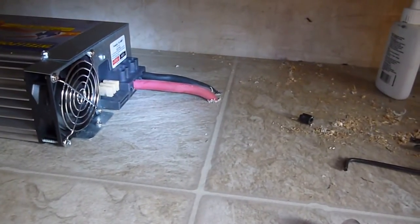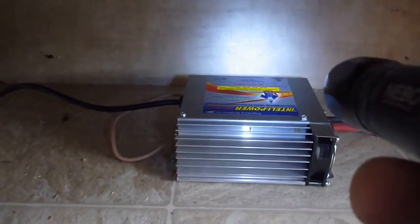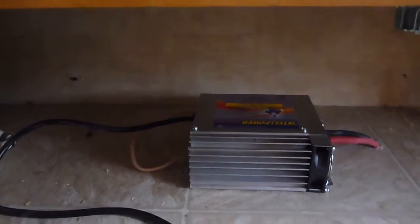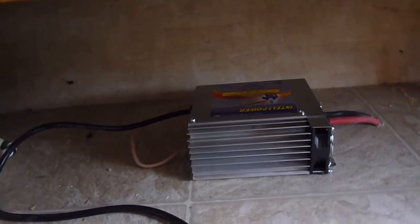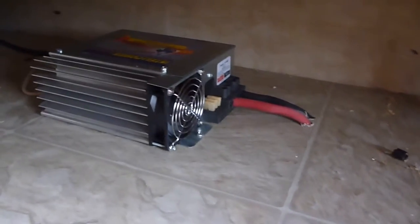They'll work just fine — if not a little better than a smaller size. The white wire on the back goes to the ground on the back of the charge controller and into the box behind it. The charge controller is still unplugged at this point — I haven't plugged it in, and the batteries aren't hooked up on the other side yet. Right now I'm just buttoning up the inside. That's pretty much installing the charge controller right there.